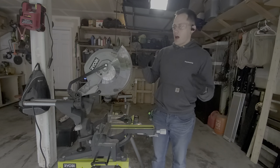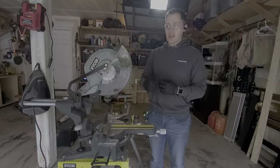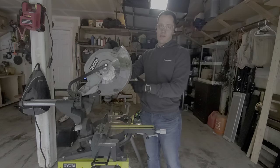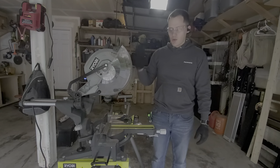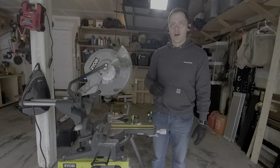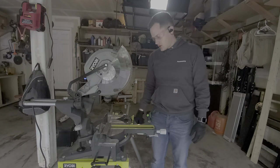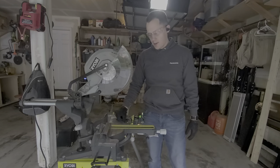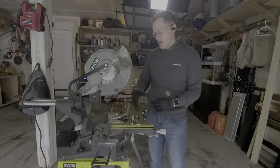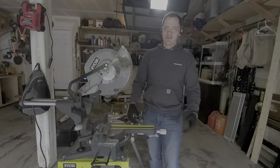Hopefully that's helpful. I hate it when people think you have to have all the right, perfect tools for the job. The right tool does make it easier and often makes a better project, but if what's keeping you from starting your project is going out and buying a specific metal miter saw — this will work just fine. Go get your $7 grinding blade from your hardware store, throw it on your Ryobi, get that little arbor spacer I talked about, and go to town. Make something cool and get some time working with metal. As you get more experience and more demand, then you can get the more expensive stuff. Let me know in the comments if you have any questions.